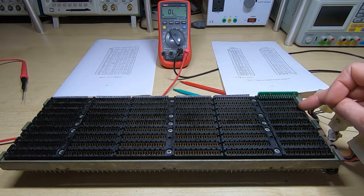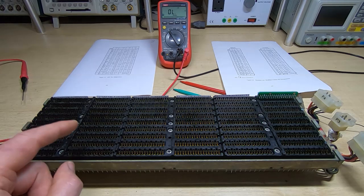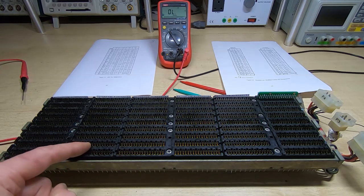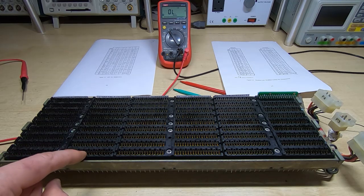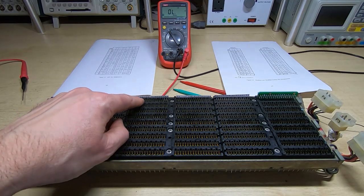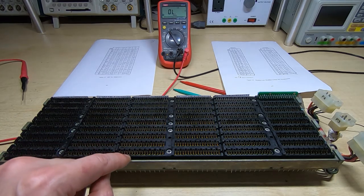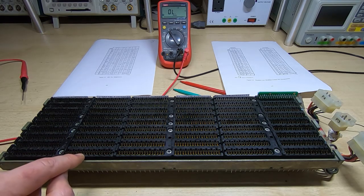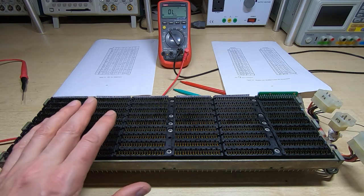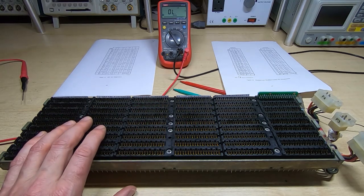The pins are labeled with letters from the right and each connector has a front and back which is given a number. So you might get something like E01P1 — in that case that would be slot E, O1 is row one, and P1 is pin P at the front. One is at the front, two is at the back. So in this case it would be slot E, pin P at the front. It's quite straightforward — it's very easy to find pins once you understand the basic way that they're identified.